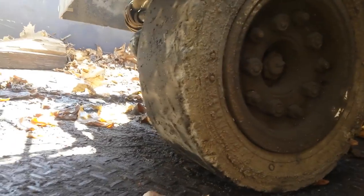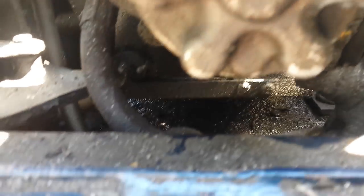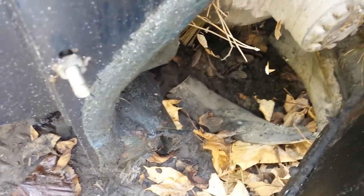It's got the drive wheel back here, and on the other side is a big hydraulic motor. It's pretty worn out — I think it's got a lot of hours on this machine. We burst a hose on it, and it's down in here. The hoses are all very hard to access on this older model. The motor is mounted right behind the sweep, right above the main broom. There's the hydraulic motor that powers it — pretty worn down. I've got an extra one, and the rubber's coming off this one.